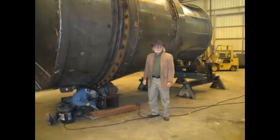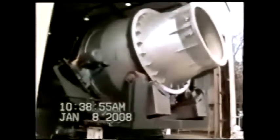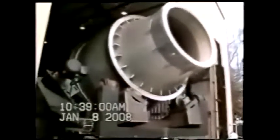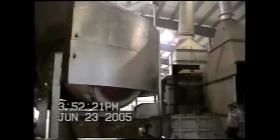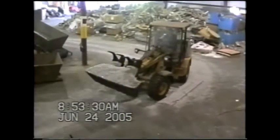The development of the SuperMelt Rotary Furnace System by Mansell & Associates incorporates the genius of design engineer Ed Mansell of Rotary Sweat Furnaces. The SuperMelt Rotary Furnace is mounted on a tilting frame with a 360-degree swivel base that allows the furnace to pour, slag off, and charge at various locations around the perimeter of the base, which reduces cycle time up to 35%.